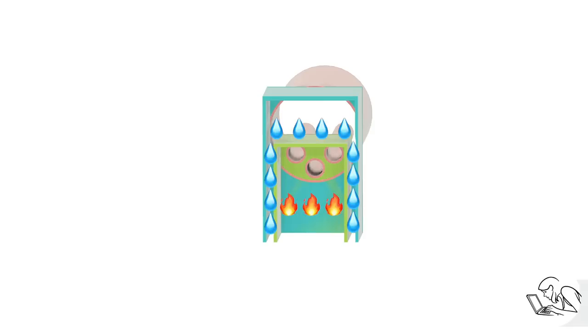And it's surrounded by water both for safety, because it buffers the heat of the coal fire, which can be white hot and extremely intense, and of course it's also for efficiency, because it captures as much of the heat of the coal fire as possible. And then the bottom there is open so that you can dump the ashes out.